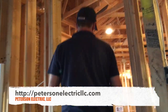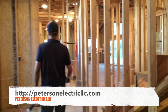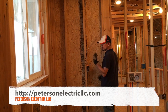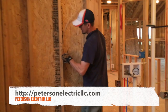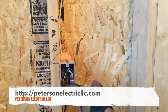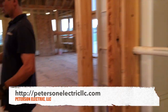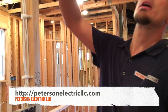When I make up all my plugs I actually use two, three, four, and six-port connectors and I try everything through at the beginning of my rough-in, so when I come back to trim out all I have to do is two wires and stab the device. As you can see, this port connector allows me to tie it through and then it allows me — as I label — to know where the end of my circuit is. The end of this circuit, for example, is in this box, and when I know it's in that box I can check my power in my cans.